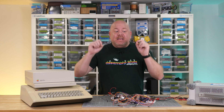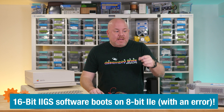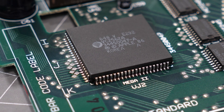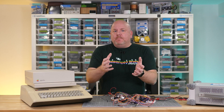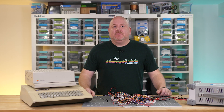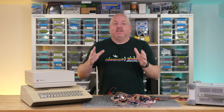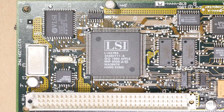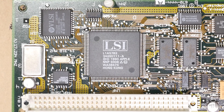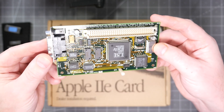In fact, when the 2GS turns on, it thinks it's an Apple 2. Software has to hit registers to enable 2GS features. So then what is that huge 84-pin PLCC doing? Well, for backward compatibility, its primary function is for the characteristic Apple II graphics modes. Seriously, most of the logic in the Mega 2 isn't even used by the 2GS. Now, a later revision was a chip called Gemini, which was integrated into the Apple IIe compatibility card for the Macintosh LC series computers.